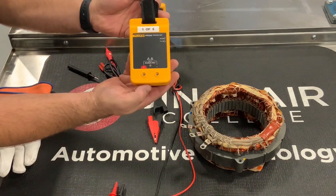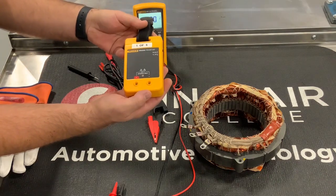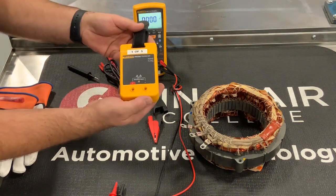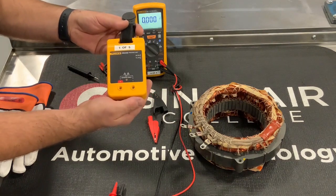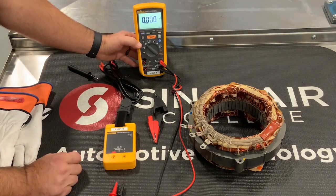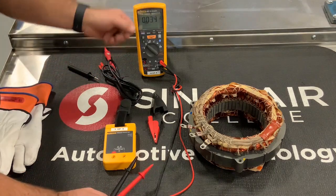This proving unit will provide 240 volts AC or DC, which is selectable. Since I'm usually testing a high voltage component on the DC side, that's usually all I'm concerned with. This isn't exclusively used for EV work — it's also used in the electrical industry. I have my leads in the typical spot, and I've got a category 3 meter with a 1000-volt rating.